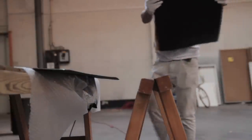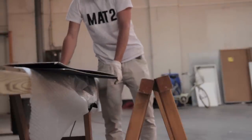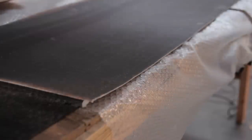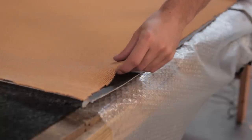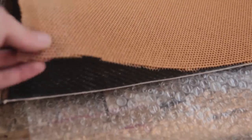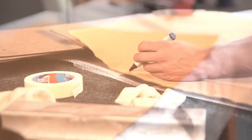The plate is still very flexible and shows some deformation — this is mostly due to a non-symmetrical layup. The jute side absorbs more resin than the carbon fiber backing side. If you want a flat plate it's better to use jute on both sides as backing, but knowing that I'd be bonding everything together and adding an extra carbon fiber layer, I decided to go with two layers and then an extra layer for bonding the two plates together.